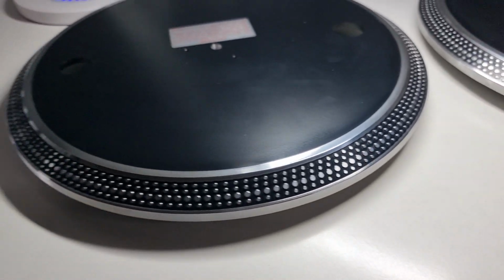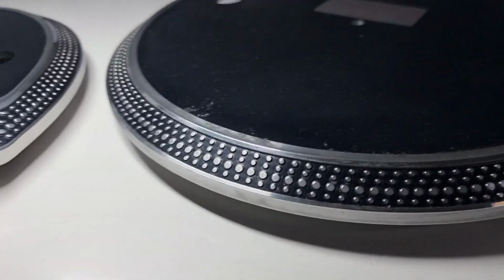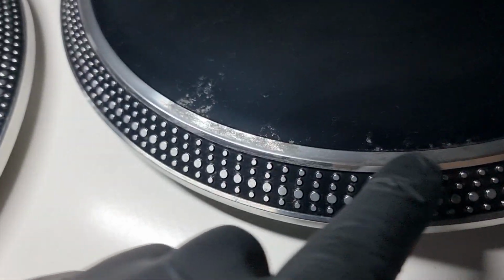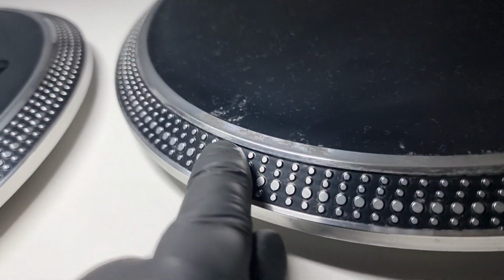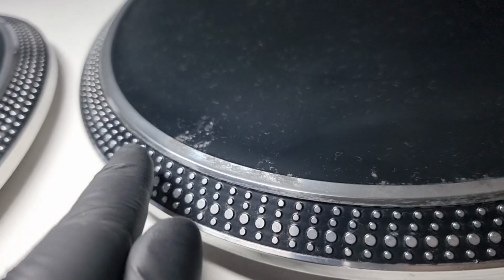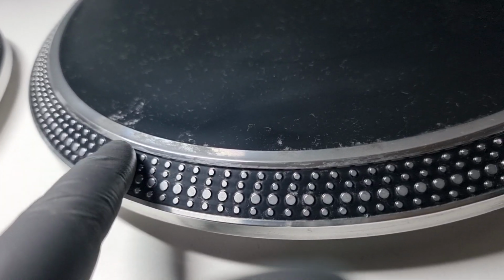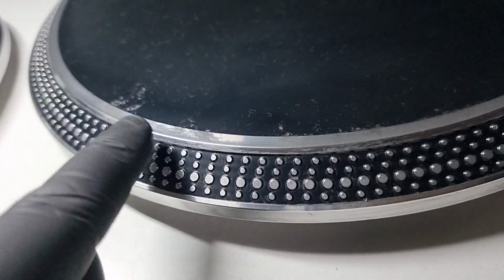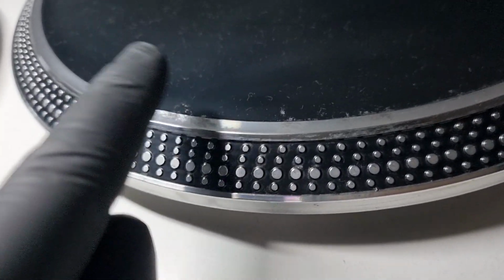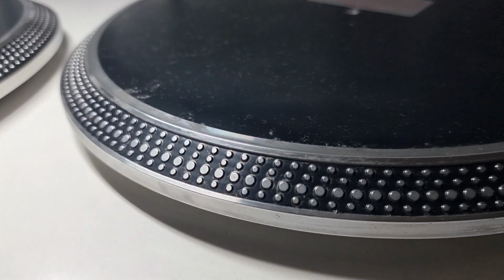As with anything though, I cannot work miracles. If you look at these two platters, these are another two that I tried. You see how bad the tops of these are. Now if I really wanted to, I could get this out. You see all these markings around the side here. If I put this through the machine, I can remove these. The problem is, what most people do whenever they see things like this is put the heaviest compound on, the heaviest wheel on, stick it on full power and eat through it, which is fantastic, but then they end up warping the texture of the actual aluminium on the platter itself, and that's what misshapes them, and that is what removes the strobe dots.